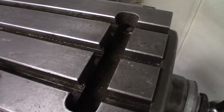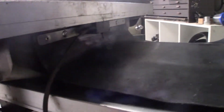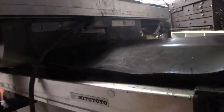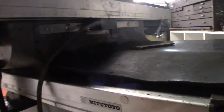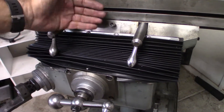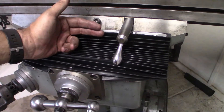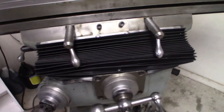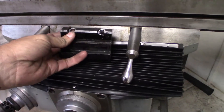While this drain hole is technically covered, I don't really use coolant anyway, so I'm not too worried about it. But the hole down in here is technically going to be covered. I do wish I would have swapped this prior to putting on the way covers - I would have done the holes differently down here. What I ended up having to do is chop out this little section here for the stationary part of the scale. This is the old mounting bracket - there was a special mounting bracket that allowed the scale sensor piece to mount vertically because it's only meant for a flush mount, but this is angled, so there's a little angle bracket.